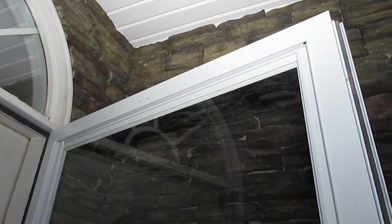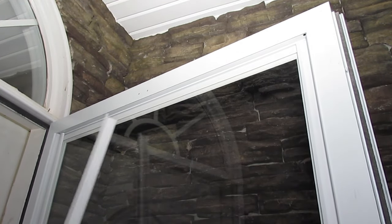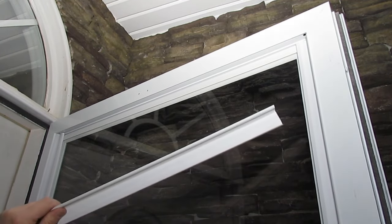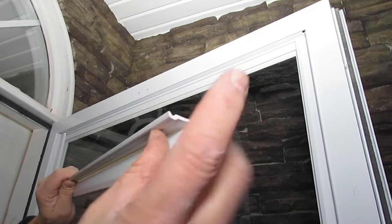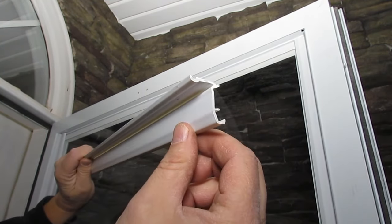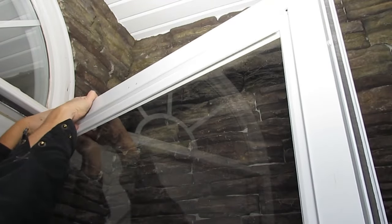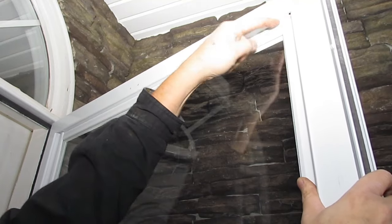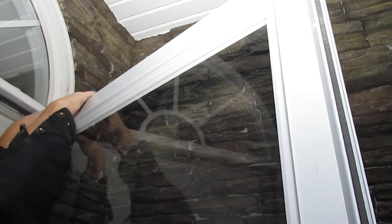This is the top of the door — there are these two hard vinyl pieces that come with it. The instructions read like the glass is not already in the door and the side retainers aren't already in, but mine has the glass in and the side retainers in already. So I've just got to put in the top and the bottom retainers and they both go in the same way — they just snap in. The flat lip goes against the door frame and the contour part goes against the glass. There's a little channel at the edge of the door mold frame and a ridge on the back of this piece that pops into that channel. Do it on the top and then do it on the bottom.